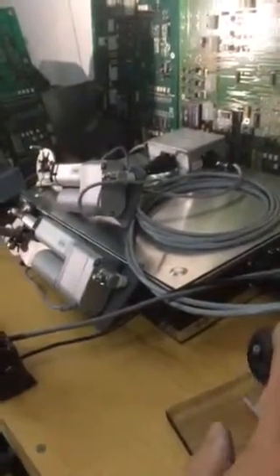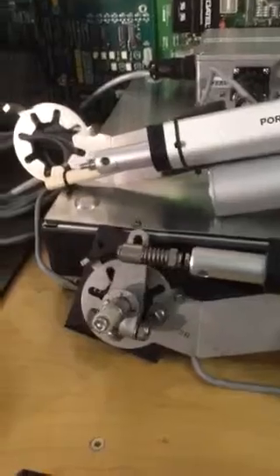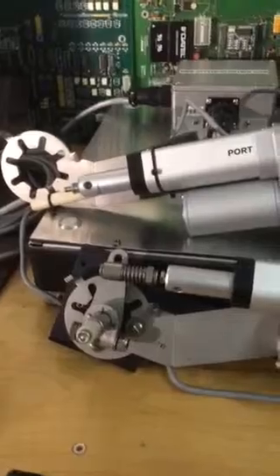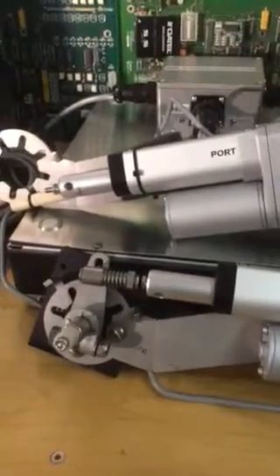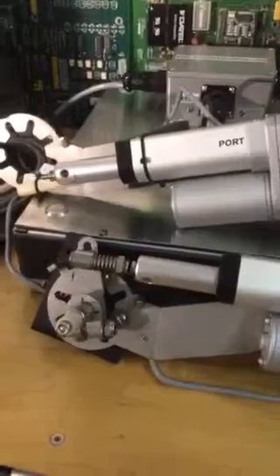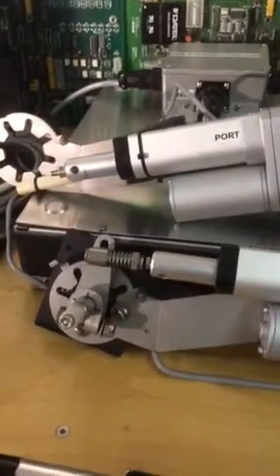You can see the joystick and the actuators move in unison — wherever you move the joystick is where they move. You can make fine movements, then let go. Say you're docking and you get nervous about where the deflectors are and you feel you've lost confidence — you let go and they go right back to a neutral position. You can go full open, full up, or full astern and release, and they all return to the center point.